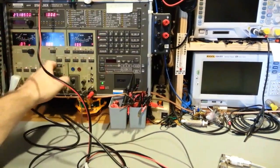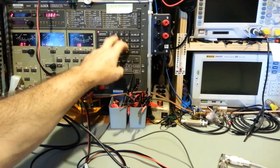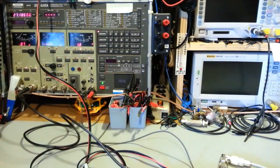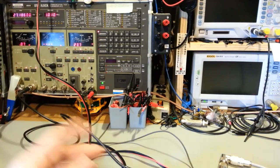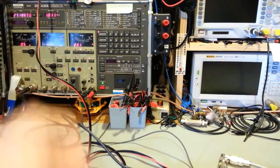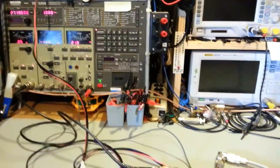And if we go for sideband, so turn off modulation, we'll do upper sideband, 27.186, put out the carrier, and we'll switch to upper sideband. And you can see at 0.05 microvolts, 22 dB SINAD. That's fantastic, man. Really good signal to noise and distortion measurement. I mean, that's really good. So it's got a really sensitive receiver.